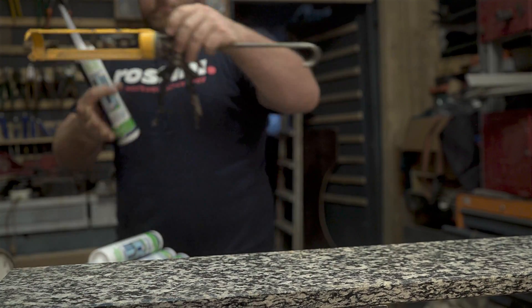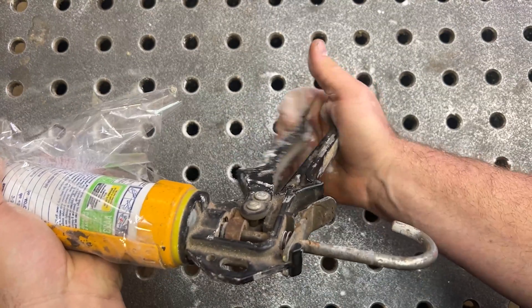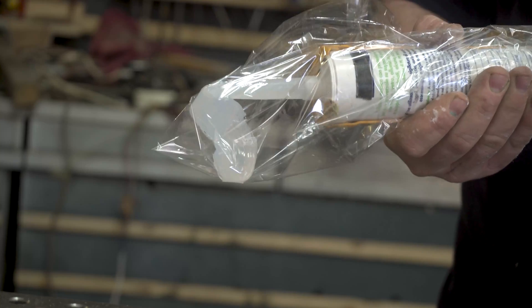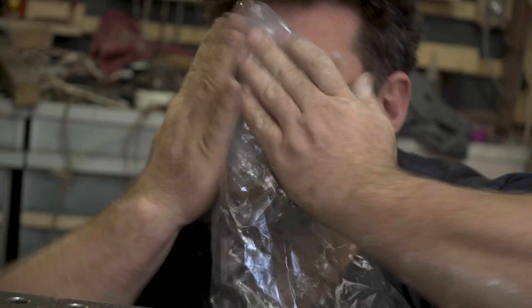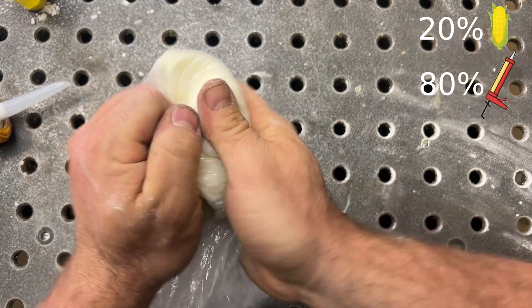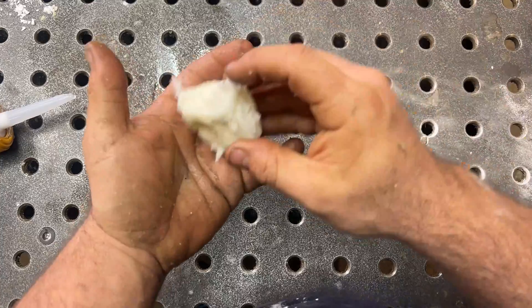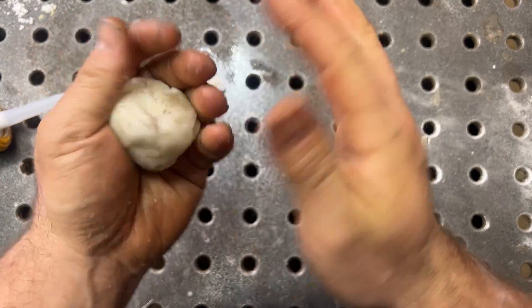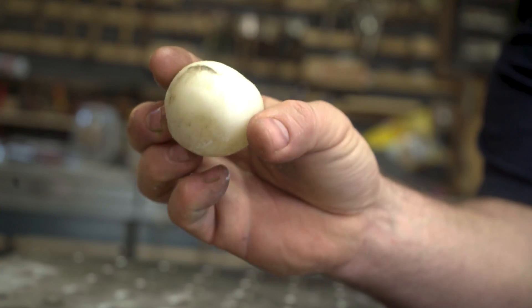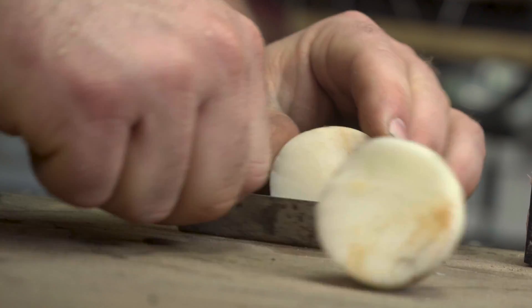We can take a transparent plastic bag — it's much easier to mix the two parts without creating a huge mess. Put the silicone inside the bag, then add the proper amount of starch to this mixture. The perfect ratio of powder to silicone depends on your needs, but usually 20% starch and 80% silicone is right. The more starch you add, the faster the reaction will get — if you put too much starch, the reaction can happen in just two minutes! And finally, this huge silicone bowl cures completely, which means that the starch works great.